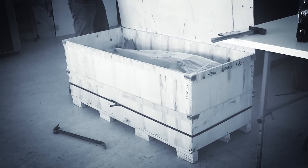Here's the second version of the shaft - it's basically the same except for that flange in the middle, which the handwheel can be screwed against, and that just helped to secure it better and make it run more true because it was a bit wobbly with the first shaft. So with all the parts done now, it's time to install everything. There's a lock nut in the back here to set the preload, and once that's adjusted there's absolutely zero play in the bushing, and the shaft turns very smooth and true. What's also nice is that if this bushing ever gets worn out, I can make a new one in like 10 minutes. Now I just need to drill and tap some threads to mount this, and before drilling into anything on the lathe I check the drawings in the manual to make sure there's nothing behind here that I might drill into.